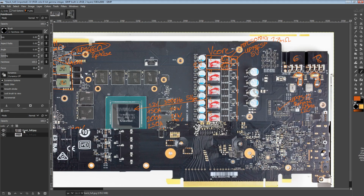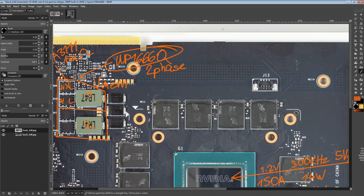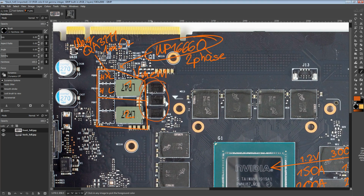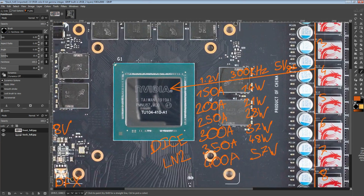And if you're wondering why doesn't MSI just use a bunch of surface mount capacitors on the output of their VRM instead of a bunch of through holes? The surface mount capacitors are significantly more expensive. So that's why you see them on the memory VRM, where they might actually have some pretty major advantages there. I guess it might also be a heatsink clearance thing, where there are mounting holes all around, so it's like, well, we want to clear the heatsink.